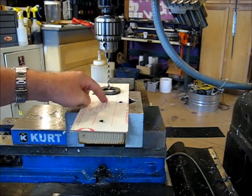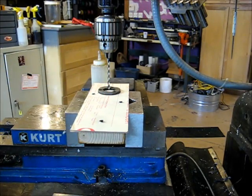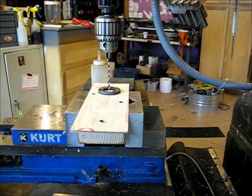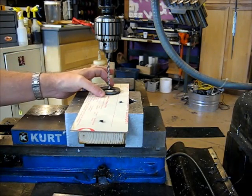Then we might not be able to get 3. I don't know if I'll be able to get, probably so. Then we're just going to do 2 more across this block, again with just arbitrary center locations. So I'm going to write down my first center, 0, 0, and go ahead and enter X and Y, 0 my DRO, and then we're going to cut our bolt hole, our screw hole pattern right here.